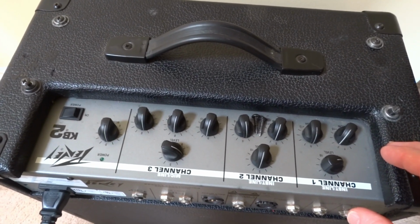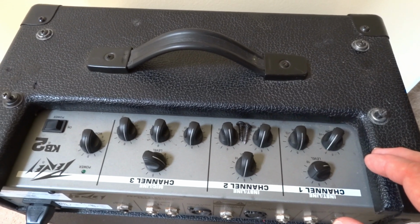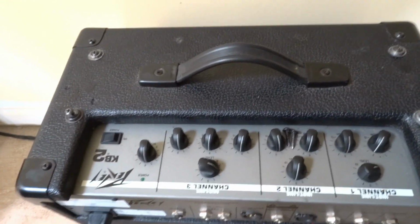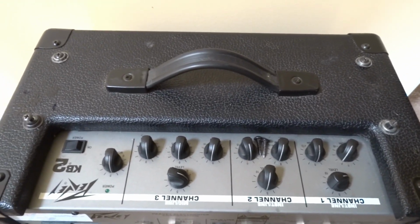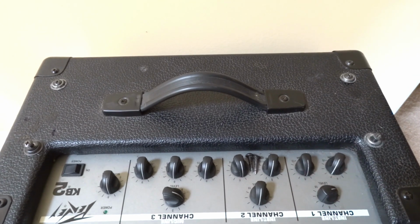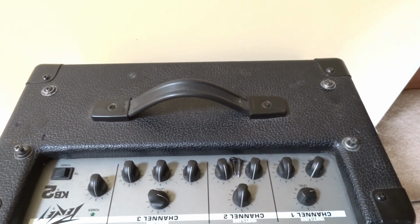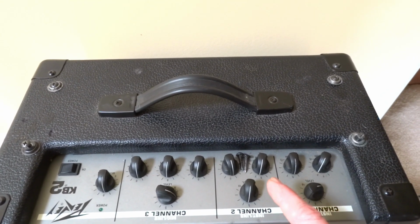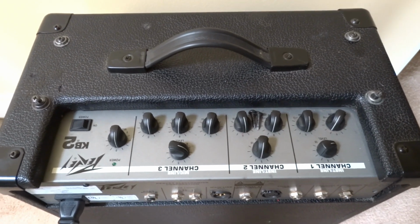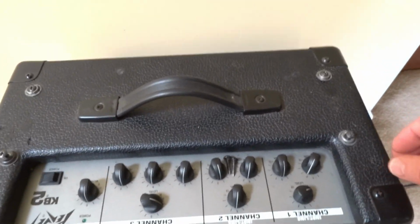And whenever I go to fix something, I initially run through my head what it could possibly be, and I'm inevitably wrong every time. But let's just throw something out there. My prediction is that it is the rectifier, from heating and cooling, and the fact that this is 2003, 2005. That's probably soldered with lead-free solder, so the solder joints failed on the rectifier. That's just for fun. We'll see if I'm right for once, and if so, it'll be on video.